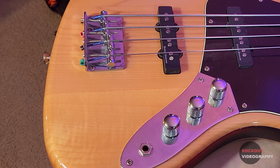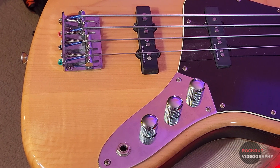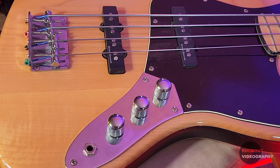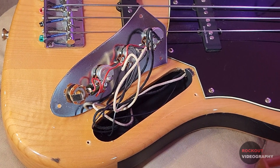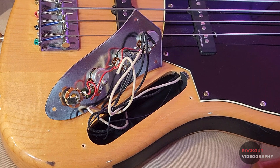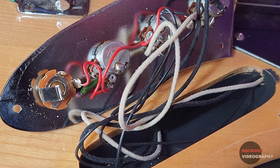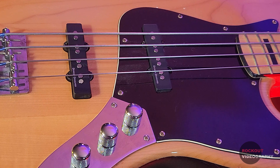It has three chrome knobs and a chrome control plate with an input jack. There are two volume knobs and a master tone knob. The knobs are not the push-pull type that give you additional controls. Inside you can see that they use small mini pots and some cheap wiring — this is to be expected and it's not really a big issue to me. However, some of the wiring is the thicker cloth type insulation and it looks like there's been some shielding paint applied to the cavity.